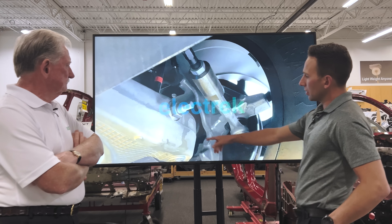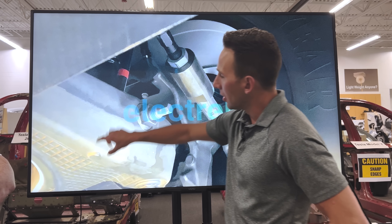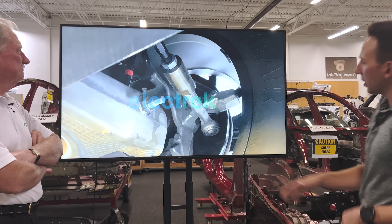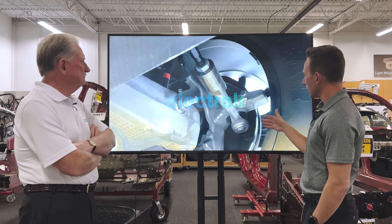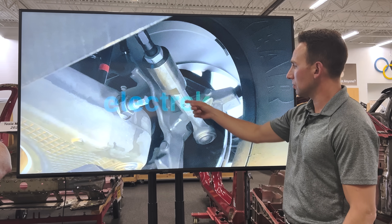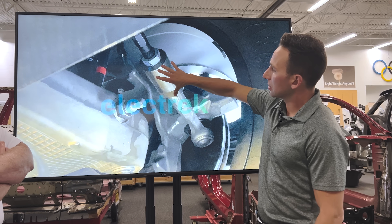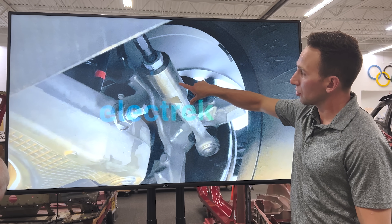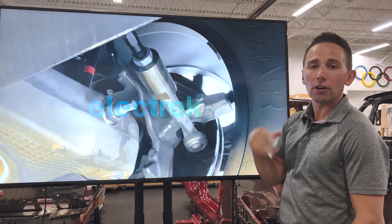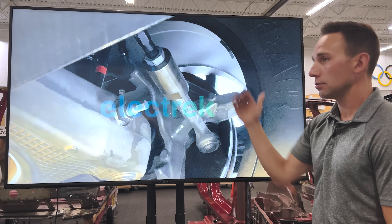Just a few observations. It looks like a low pressure permanent mold type die cast or a sand casting. It's hard to see all the witness marks to get confirmation, but these cross hatches help the casting cool and release from the mold. The thing that's indicative to me that this is a prototype — if you look at these inner and outer tie rods, the thing that connects to the steering rack underneath the vehicle — the outboard outer tie rod end, this forged aluminum piece goes into this billet machined piece of steel. In a prototype, you do it off bar stock: you don't need a tool set up, you can put it on a lathe, do a secondary machine pass, and voila, you've got a tie rod.